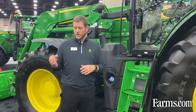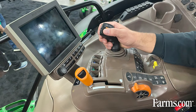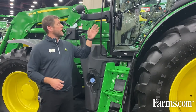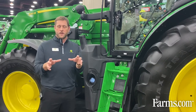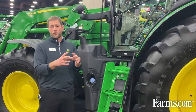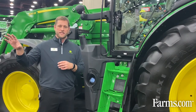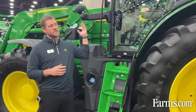Inside the cab, you've got the ability to have a programmable joystick. You've got some buttons where you can run those presets or run different components — if it's the loader bucket, whatever it might be on that joystick. One of the big things that's different on the 6 now is that you don't have the instrument cluster right there in front of the steering column. Now it's all over on the corner post display, similar to those other tractors — the 7 through 9 series. Visibility is improved with the instrument cluster no longer there, and those corner posts are very narrow, which really helps visibility.